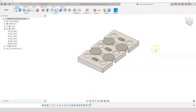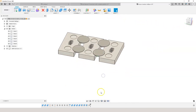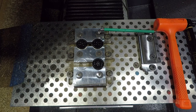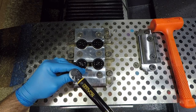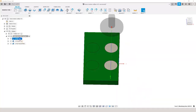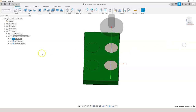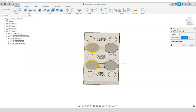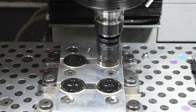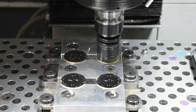Time for the 1100 MX to really step up. We needed to face both sides of the parts and put a really nice fillet on the outer edge. I chose a dual-station vise setup so I could run two soft jaws — technically three — and four parts at one time. To face the parts we used the Tormach Superfly. This fly cutter tool has quickly become one of my favorite tools because it's basically just a big single flute. The insert angle really helps balance the axial and radial forces. For the insert we used the polished SCHT. I ran it at 2000 rpm.